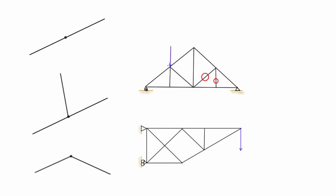Now when we look at this joint, we actually can't say anything based on it because it has an applied force at it, so we're not sure. What we can do is come down and look at this other joint — it's not the joint with an applied force on it, so we're good to go. We have two members collinear and one that's not collinear, and that means if this had any amount of force in it, it would make this joint out of equilibrium, so this is also a zero force member.